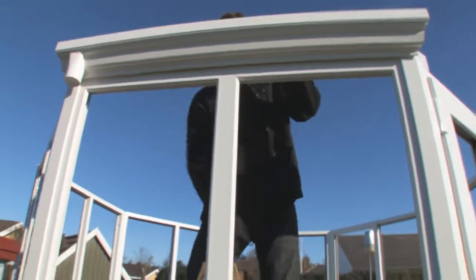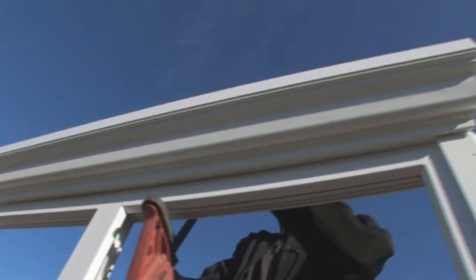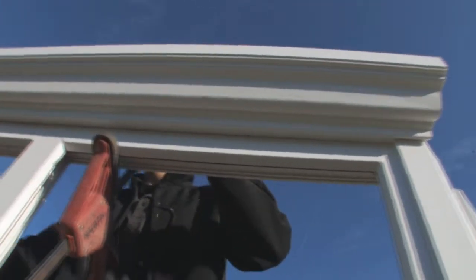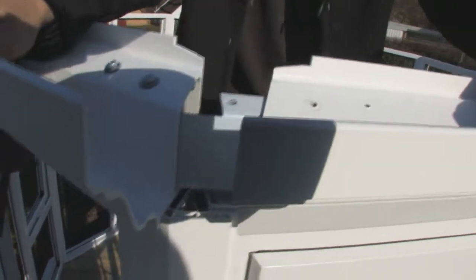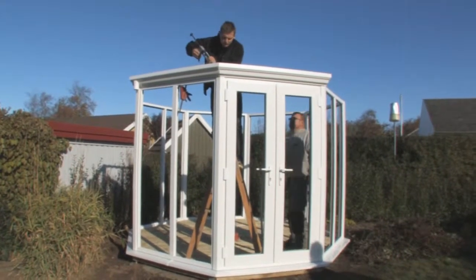Find out where you want to place the downpipe and start with the gutter with the spout. Do not place it at a window aperture. Push the gutters together on top of the element and tighten the screws in the 2 holes furthest out in the gutters. Remember the 3mm joint between the gutters.